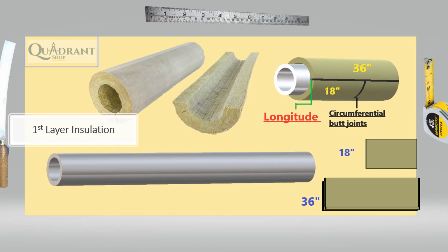And I've seen other places where you have thick heat tracing tubings, so I would probably order something like a 3.5, 4.5, or 5-inch pipe size. It gets complicated when you have supports, especially on the tubing. The tubing, I believe, breaks every 10 or 20 feet, and then you gotta make cutouts around that, right? They're like little loop cutouts you have to make. So you have to order a size bigger. That's the whole purpose of this.